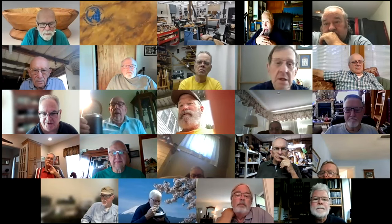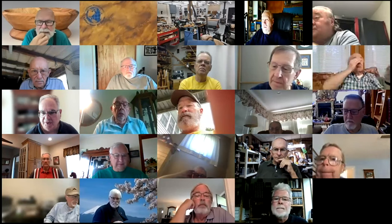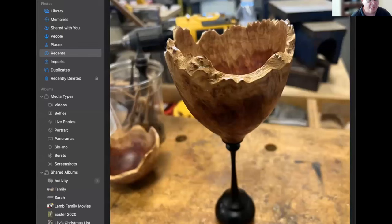Yeah. Let me show you a quick something, which I think is the same kind of thing Toby is talking about. And it's something I work on as well, is to try and orient the view in a burl. This is a red mallee burl, where I've put all the eyes on top, tried to get that natural edge to show there, and then hollowed out to give you the rest of the detail on the sides. So I think orientation of the burl is a really important subject if you're going to try and get the features that you want by how you orient it.